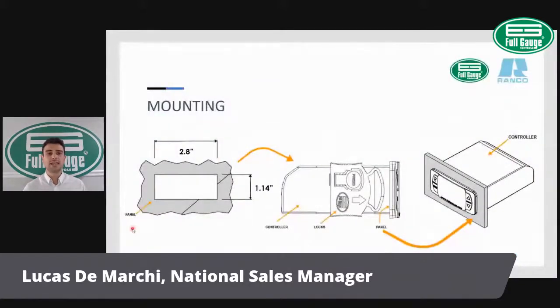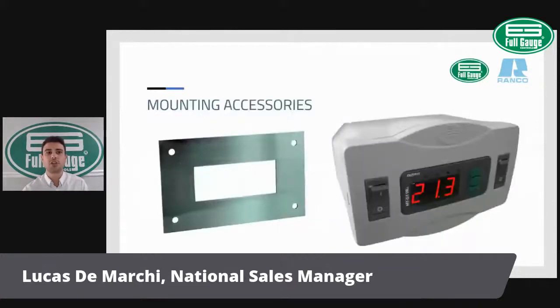The controller is mounted in a 2.8 by 1.14 inch cutout. That's the same dimension and cutout as virtually any other digital refrigeration controller. So again, this instruction can also be used to replace existing OEM refrigeration controllers. If you don't have that exact cutout, we do have other accessories that can support your mounting procedures. We have a stainless steel flat mounting plate, as well as a plastic enclosure, and other mounting accessories that can make your installation easier and quicker.